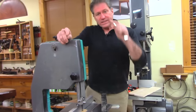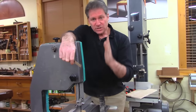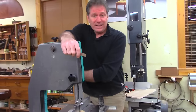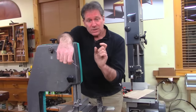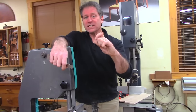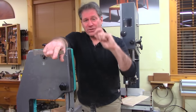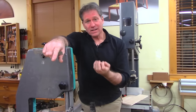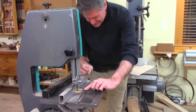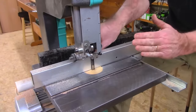We're going to have a nice safe cut making these lines that go into the edge. I want them to finish at 3/32" by 3/32". So my recess that I cut into the table is 3/32". Now the line I have in the table is an eighth inch wide — you might ask why make it 3/32" and not an eighth? If you did an eighth of an inch, it would look almost 3/16" on the diagonal — that looks fat. When you use a 3/32" by 3/32", it reads on the edge like an eighth or a little fuller than an eighth.